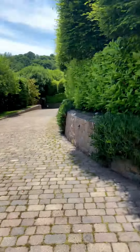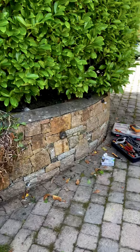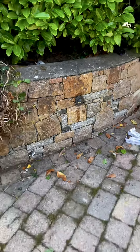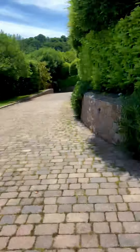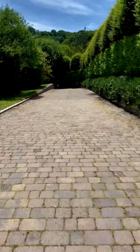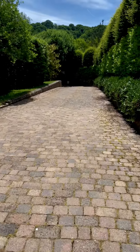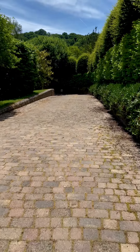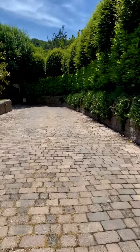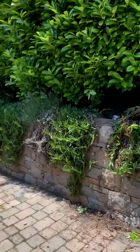This whole drive, which is maybe 50, 60 meters long, runs 12 volts AC. We inject it at one end here and with the correct LED modules these are absolutely fully energizing right through the gates at the end to the entrance lights. I think we've removed maybe 12 points of failure from the system. Some individual transformers we've refreshed and some jointing too.